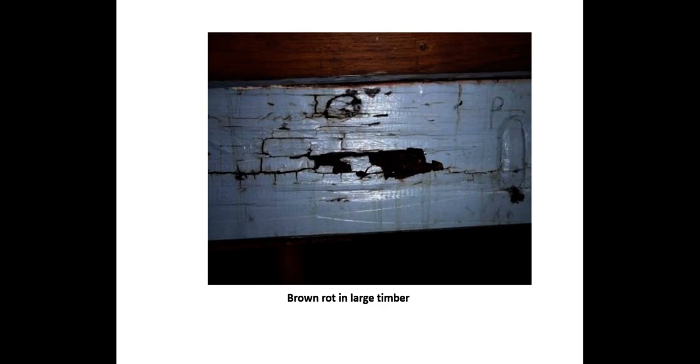In a wooden vessel, fungal decay is the primary cause of deterioration. One may even say that a wooden boat begins to decay while on the building ways. The causes of decay are varied: a felled tree lying in the ground before milling can yield poor material, new growth of green timbers, insect infestation, structural defects in the grain, workmanship, and the usual suspects — lack of ventilation, lack of maintenance, and poor housekeeping. Incipient decay in timbers is insidious and can be difficult to detect. One method is to culture core samples of the various timbers prior to construction to determine if or what type of fungus is present.